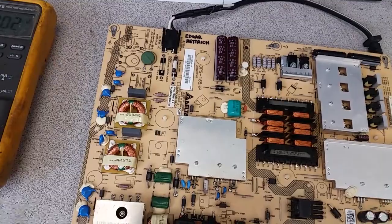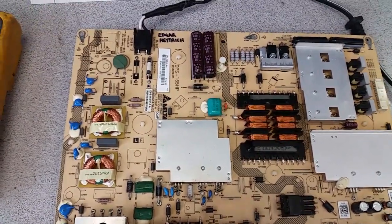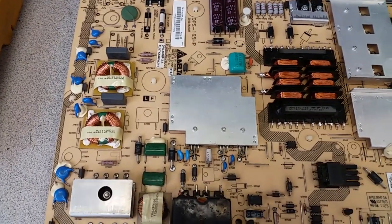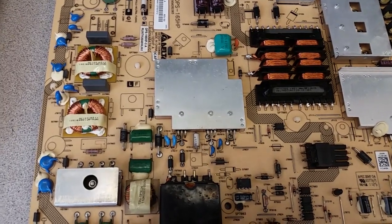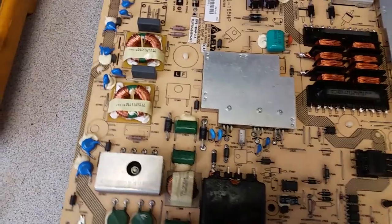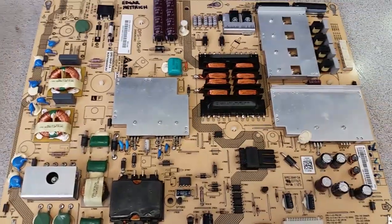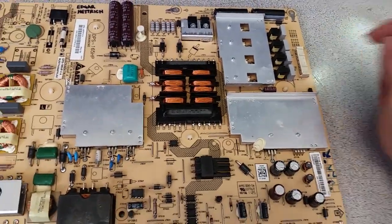I've seen several different levels of failure on that board. I've seen only the capacitors and the fuse. I've seen the driver and some small connector resistors. I still haven't seen the transistors themselves fail on that one, but I'm sure sooner or later there will be one where they do. Again, I won't be measuring the output of the LEDs for several reasons.